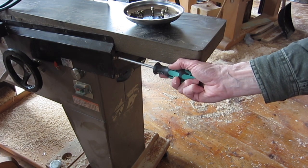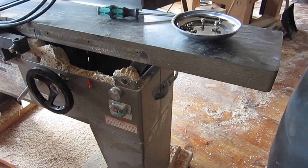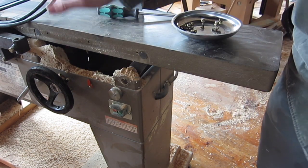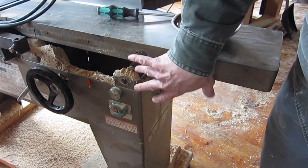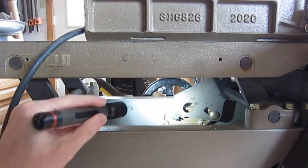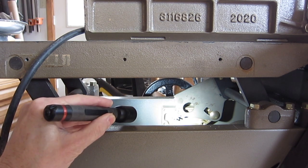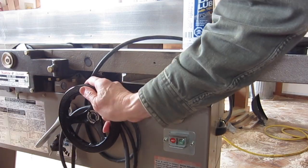You may need to loosen these four screws on the end. It may not be necessary to remove the skirts in order to change the cutter head, but I was having trouble moving the infeed and outfeed table up and down, and I think it's because there's so much sawdust buildup in the joints. With the dust cleared out I can see the pivot joints and a rack and pinion gear in there, so I'll lubricate that with a dry Teflon lubricant. That moves quite smoothly now.